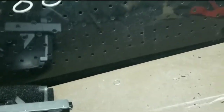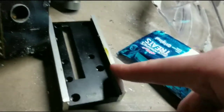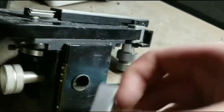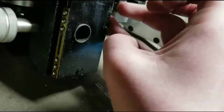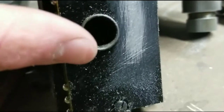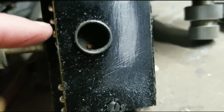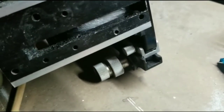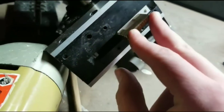What I'm going to do next is super glue this on. Now that this piece is removed, I'm going to sand this area so that the super glue sticks better. Since there is no nail system to hold it in, I'm just going to super glue it and hope for the best since I just want to get this project over with. I might want to wait before gluing to see if I need to add any spacers or sand off any space to check if this fits and aligns with the other gears.